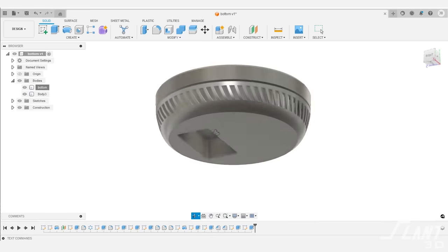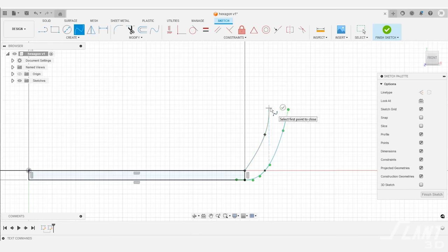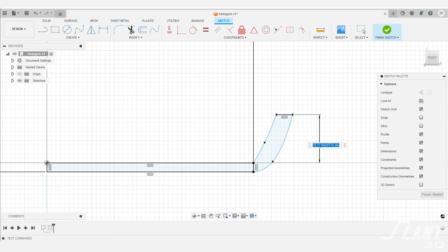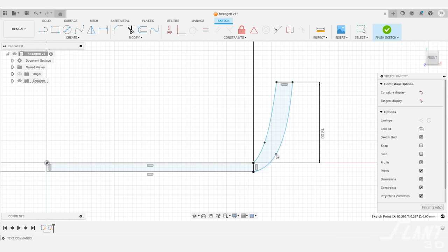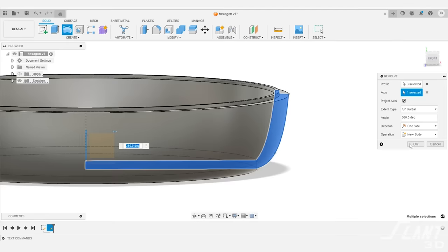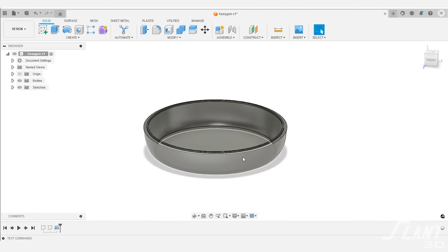Given the constraint that this part must be round from an industrial design standpoint, how would we approach it? We would design it basically the way it is, starting with the bottom layer. We changed the side profile just slightly — rather than being a chamfer that curves all the way around to horizontal, it's truncated. It curves a bit and then cuts off, which doesn't really change the cosmetic very much, but avoids the warp and nasty surface you'd otherwise get.